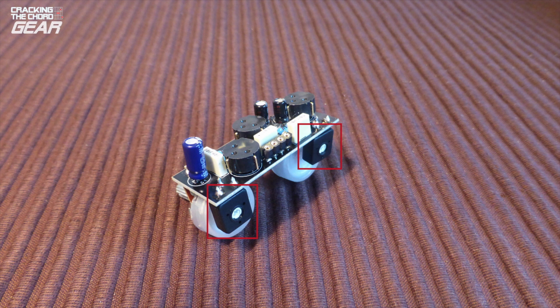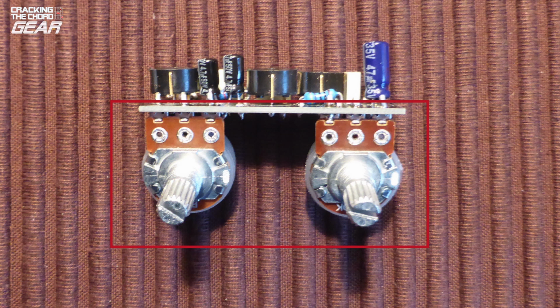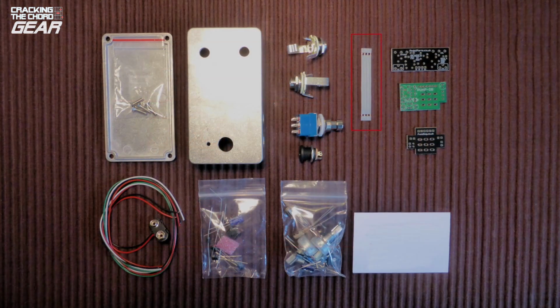The time came to install the trimmer pot. The bias for Q3 should be adjusted by setting the resistance of its trimmer pot to 8.2K before it's installed, and this was checked with a multimeter. I set the Q2 trimmer pot wiper to the centre before installing. With both trimmer pots soldered in place, I then soldered the volume and attack pots in place. A good lesson in putting anything together is reading the instructions all the way through before you start.